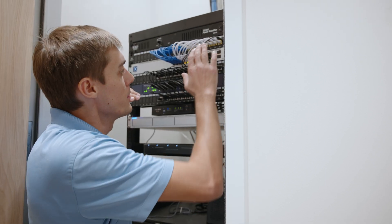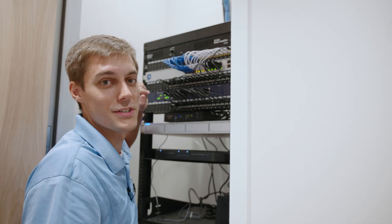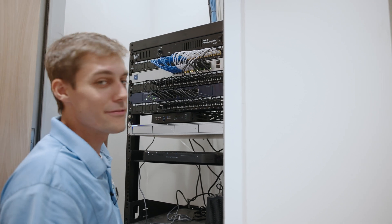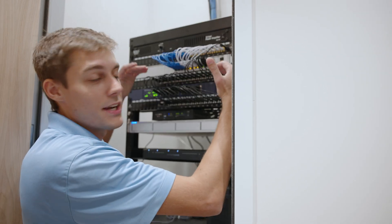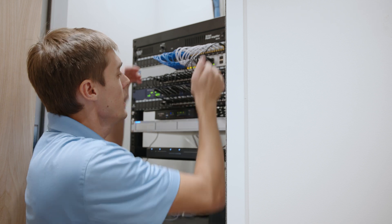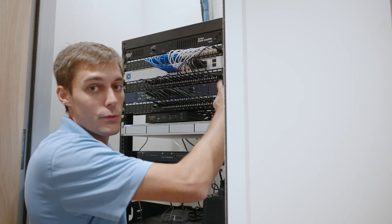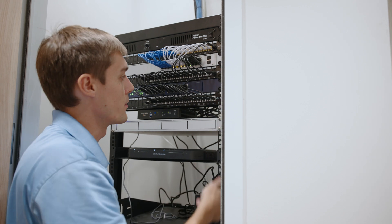The remaining ports on this switch are all data cables, so I patch those up to take full use of my switch. During our project they added a few more runs than anticipated, which ended up completely filling up my switch. I like to typically do 12 ports up top and 12 down below on a 24-port switch, so you're patching up into it and down into it — a really nice, clean install with no crossover from the lines. I leave port 24 available and patch that into my corresponding port 24 on the switch, so you know where your lead cable is that goes back to the firewall.